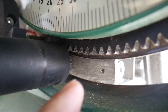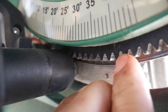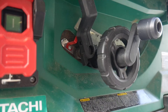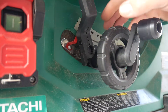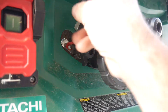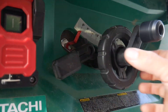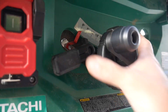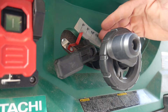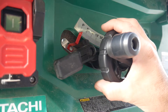As you can see in there, the gears are stripped off of this. This piece right here is metal and this piece right here is plastic, so it strips out. One reason why it strips out is when you have it set all the way at zero degrees and you loosen this knob one turn — that's enough to get it started going. But as soon as it gets about halfway or down to the bottom, this arc starts getting tight again, so these gears strip out.